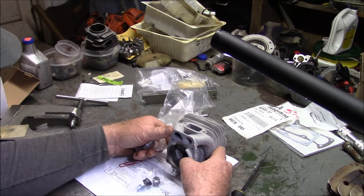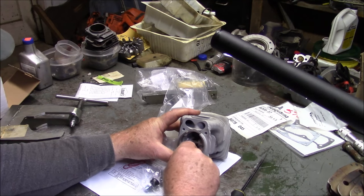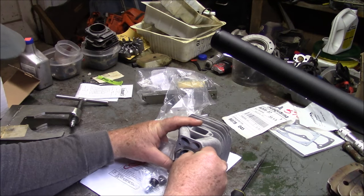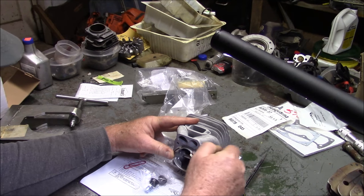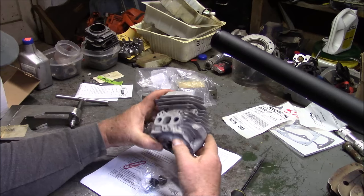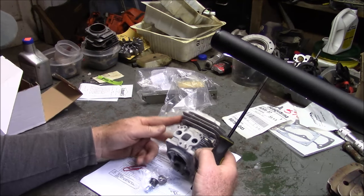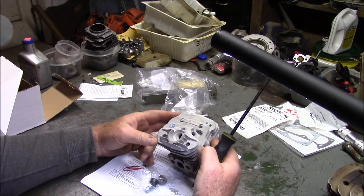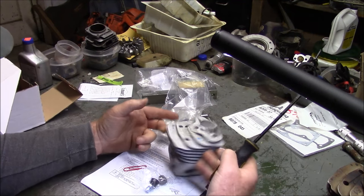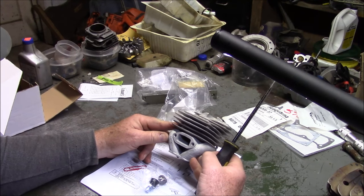The kind of things I will do is muffler mods, and I will increase the intake duration some. That makes perfect sense based on the size of the intake port that I'm seeing — they're tiny. The more I see of the 576 for those mid-size saws, the more I like them over the 372 X-torque.